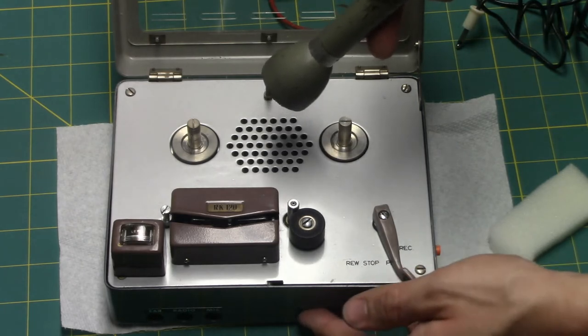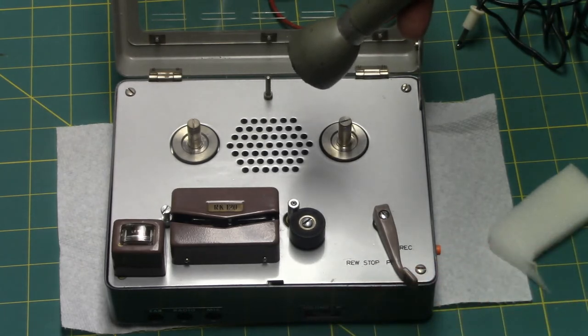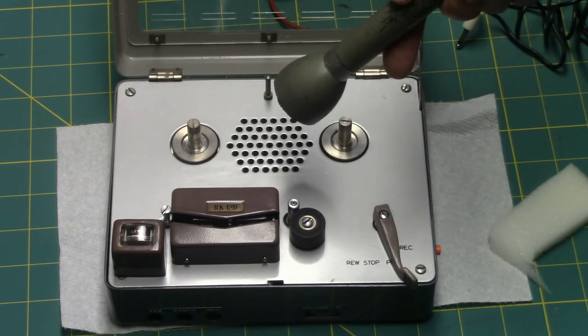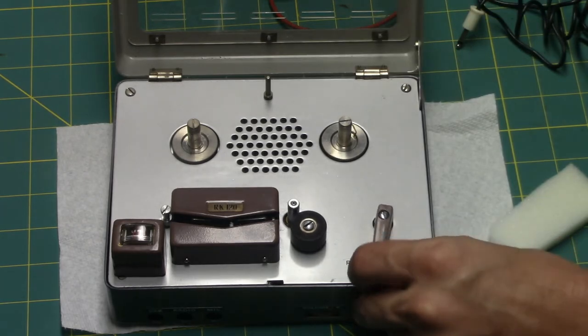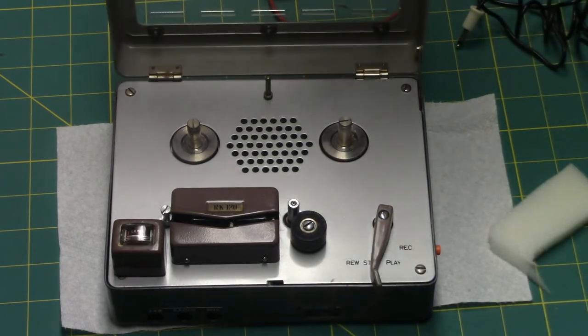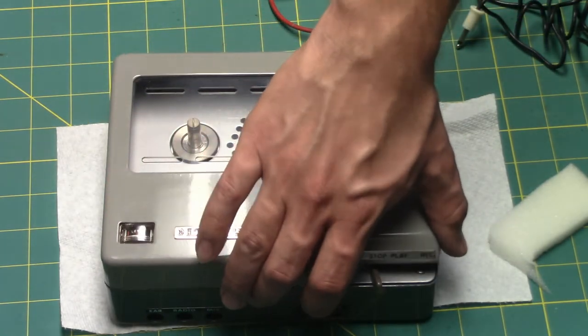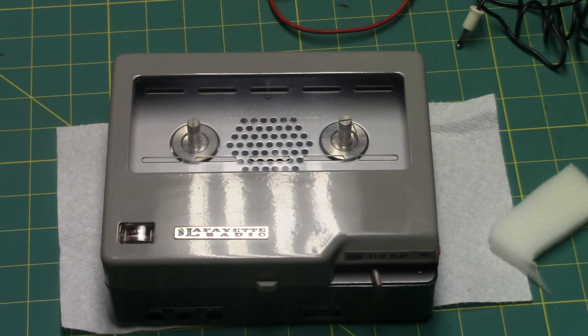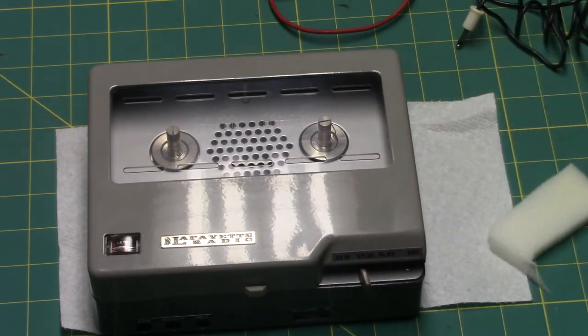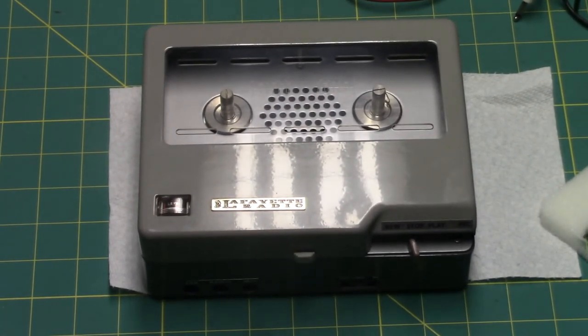You may be able to hear the noisy transistor. You may have heard the random static noise generated from the amplifier — that is the telltale sign of a noisy germanium transistor. That's how I determined there's probably a noisy transistor, because I've encountered them before and they sound like that. Interestingly, a noisy transistor would probably work well as a noise source for a true random number generator.